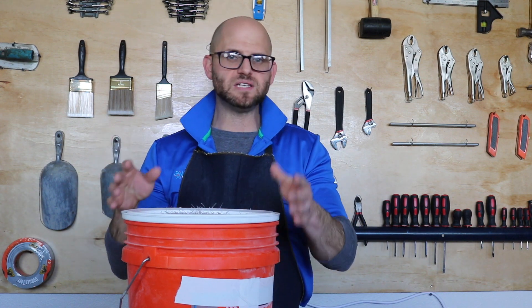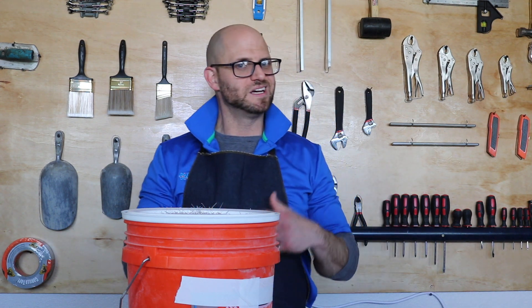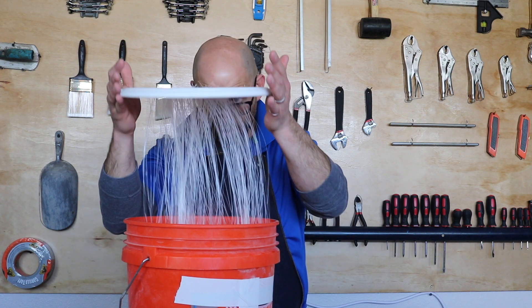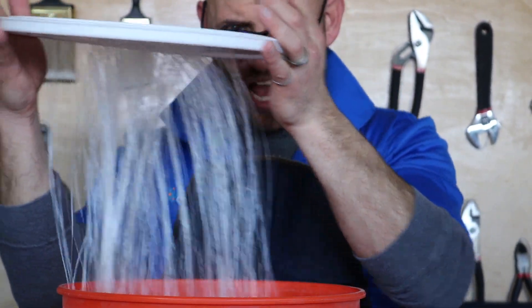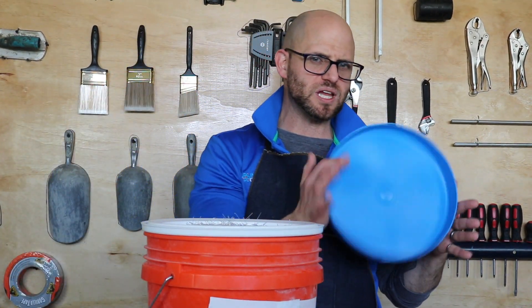To do that we need a few things. It needs to be a very fluid mix — I would almost say a fluid grout — with a lot of fines in there. It's got to go around all these fibers, and then we've also got to reduce the tendency for shrinkage, which also gets back to cracking. And this is what the mold is going to look like.